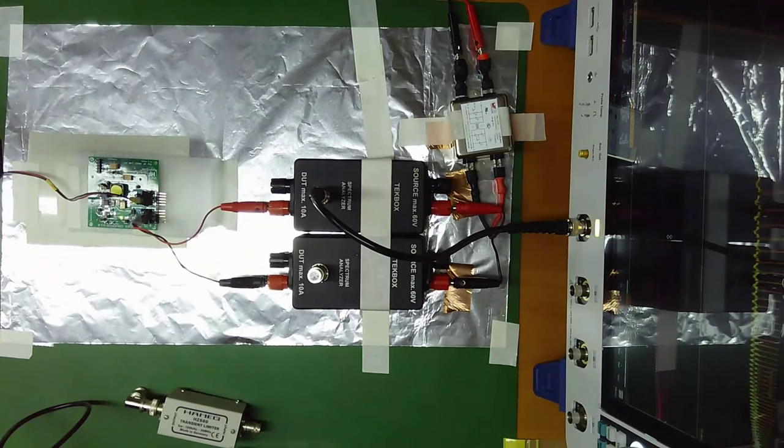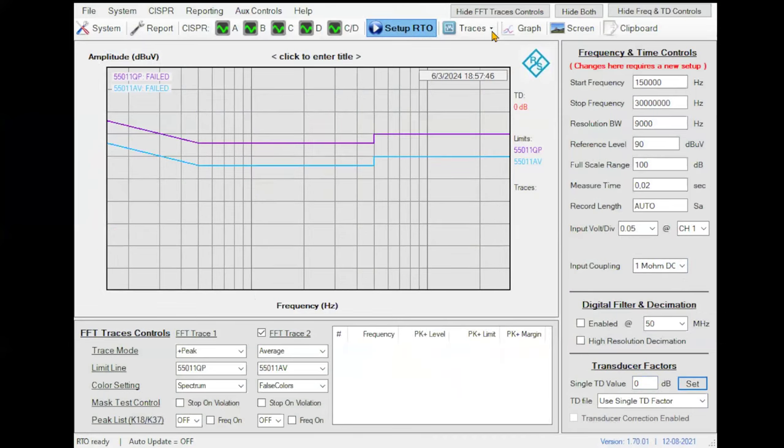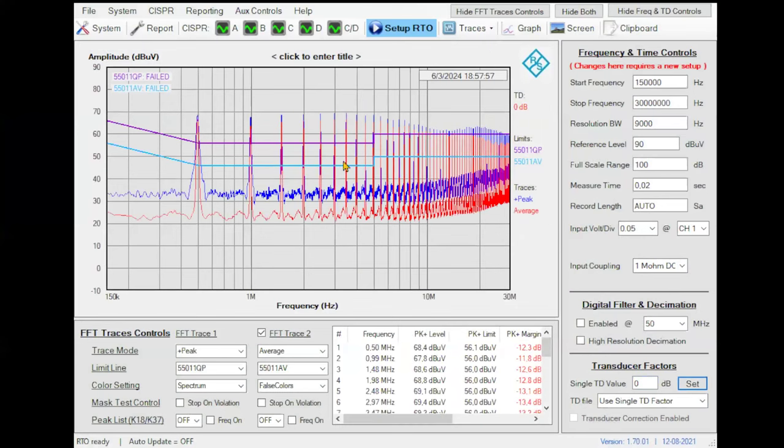Now I am going to put here again 0 dBs in the transducer factor because I have removed the attenuator. And let me put 1 megohm, set up RTO. And now let me measure again. Let me see if it works. Okay, you can see that the peaks are going down, but I have here some kind of a mountain increasing